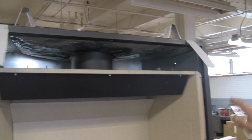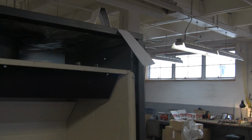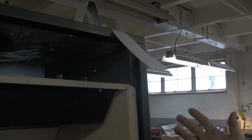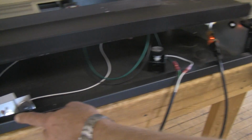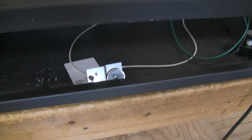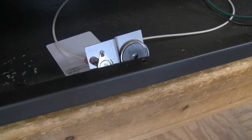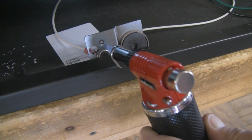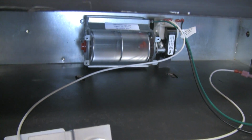So as a visual, and this is a small blower and a fairly large insert, you can see that by adding a blower to the unit, we are throwing some air out into the room. Now, just based on temperature, my speed control cooled off enough and it automatically shut the blower off. So that meant that you had turned your fireplace off, now the blower went out. If I put heat back on here again, the blower comes back on automatically.